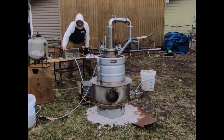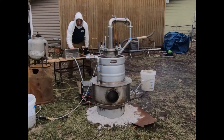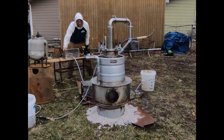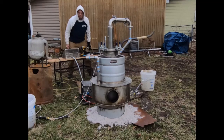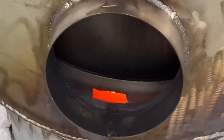There's not enough oxygen in there to get an explosive burn, so that's the safest thing to do. You can see here I am now turning on the diesel. We're going to transition. We're getting a couple of puffs there. We're now running and turning the air up a little bit more to compensate for that addition of fuel. Right there, I've just turned off the propane. We have now successfully transitioned from the propane ignition fuel to the diesel running fuel. This would not need to be done with waste oil — you could just go straight to waste oil. We got a good, decent burn.